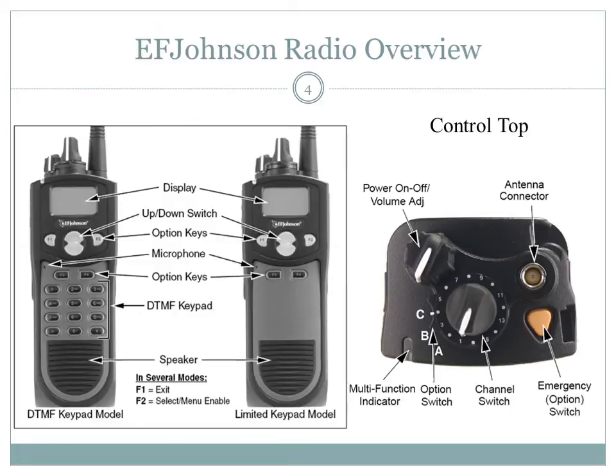The state currently has several models of the EF Johnson 5100 series radio; yours may be similar to one of the ones presented on the screen. The on-off volume adjust knob is located to the left of the control top. Rotate the knob to set the volume level — it is recommended that the best setting is with the white line straight back. The channel switch can be rotated to select channels 1 through 16, and the channel you select will appear on the display.